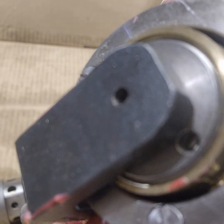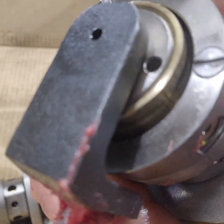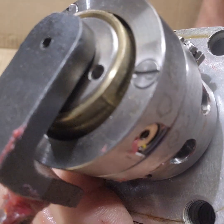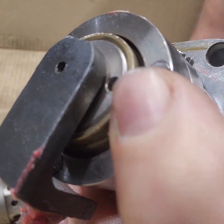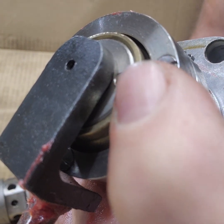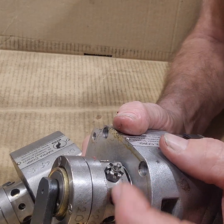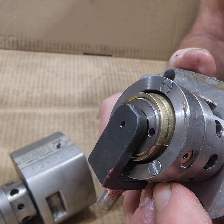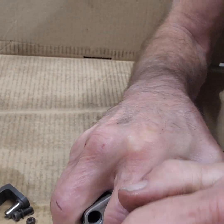I don't know if you can see them — yeah, right there's one. Right there it is, I was on the wrong part. Those three screws right there. This slot right here — that is a cap that's actually pressed into the bearings, because this bronze piece is a bore that two bearings are pressed in. This is a cap. You use a spanner wrench and you tighten it up against the outer races. So you take this nut off, you unthread this, you take these three straight slotted flathead screws and take them off. And what you get is this right here — you take the screws out and this will come off.